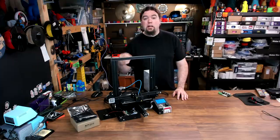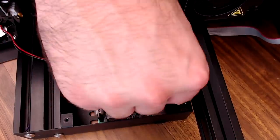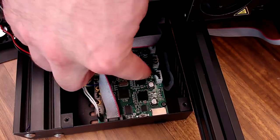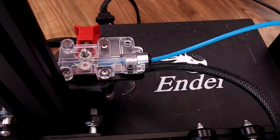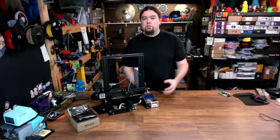In my case, the reference voltage was fine but the extruder still doesn't work. So the next thing to test is the motor and the cable. The easiest way is to move the non-functioning motor to a port you know works - we'll swap the extruder cable over to the Z axis. With the printer powered off, I remove the extruder cable and the Z cable, then move the extruder wire over to the Z axis plug. Moving the Z axis up, the extruder motor turns smooth with no issues. So we know the stepper, cable, and current are all fine - that pretty much leaves the main board as the problem. With this type of board without removable stepper drivers, it's easiest to just swap out the whole thing.